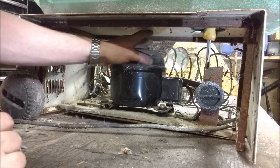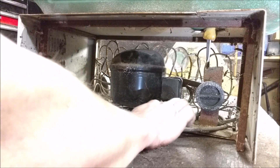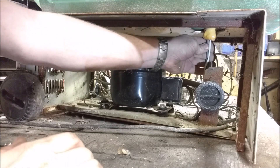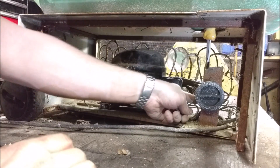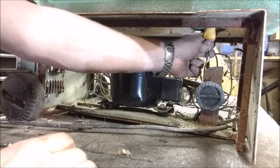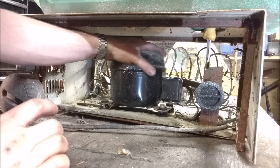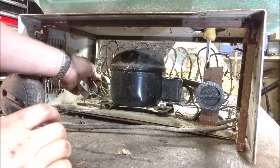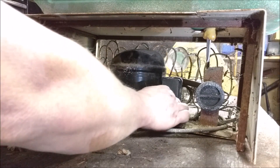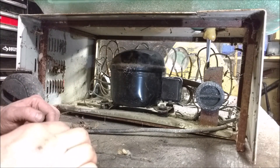And it's just exactly what it looks like — we've got a compressor and a small thermostat. If I did this again, I wouldn't leave so much room. The metal plate down here was the only thing original to the fridge. You've got two lines running up: a thermostat line and one large line up to the evaporator, plus a small skinny line running up the side inside. Since this was a throwaway fridge, the line bent relatively easily, so I could mount this almost anywhere — maybe on the side to take up a lot less room.